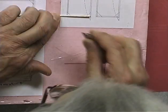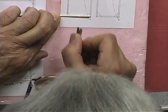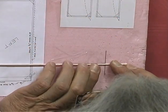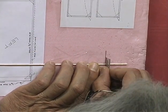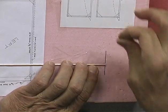What we can use that for, we're cutting a length of wood like this. You set the blade like this, you make a little mark on that wood, then you come over here and you line that up with the long piece, and then you line the blade up with that cross piece, which is 90 degrees, and then when you push down, you're going to get a perfect square cut.